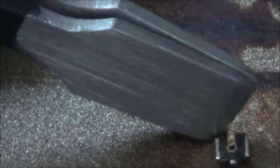But I can clearly see now through the lens of the camera that this one up here is the central conductor one. So I'm hoping I won't have to apply any more solder. I'm thinking if I just put flux onto the old one, that I'll be able to make it stick. And let me flip this thing over. See if I've done any damage to the other side. No, that looks fine. I think I might get away with that.